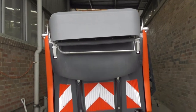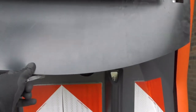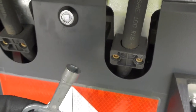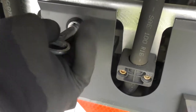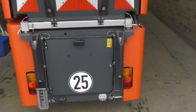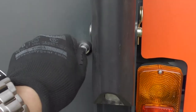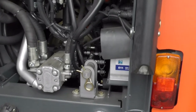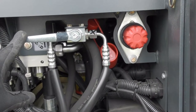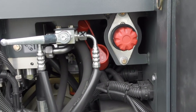Here at the rear of the machine, if your unit is fitted with a high-pressure unit, it would be under this protective rubber shroud, and the way to access that is with this key. You will receive a key with the machine together with the ignition keys — just unlock it and you will have access to the rear of the machine. There is another access panel below that, similarly unlocked with the key. At the rear you'll see a bypass tow valve — if the unit becomes inoperable and you'd like to tow it, this valve must be shut off.